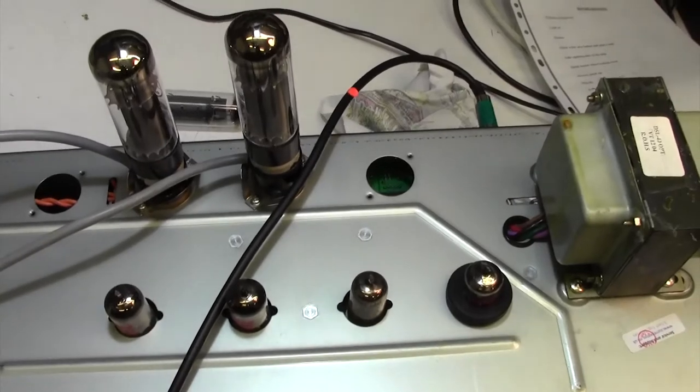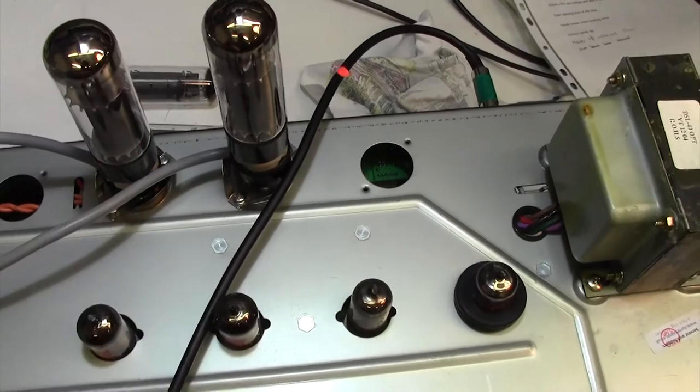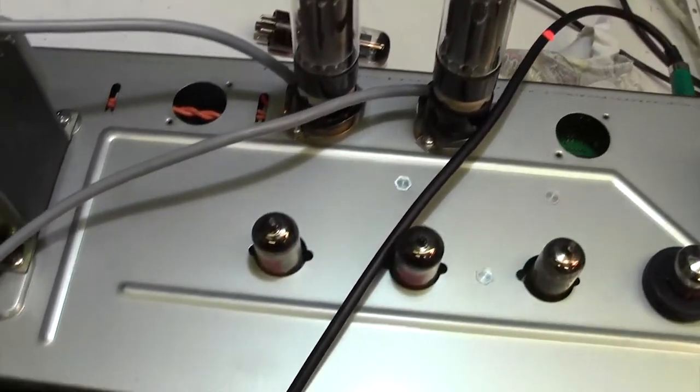Now we're quite lucky this amp is quite simple to bias but you may not have ever tried it. I'm going to show you and walk you through step by step how to bias this amplifier. I'll take the chassis out and you can rejoin me when we've got the chassis out of the cabinet. So here we are top side of the amp — I've popped in a couple of brand new JJ EL34s which the customer has requested and I've plugged in my two Euro Tubes bias meters and we're now ready to bias.